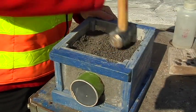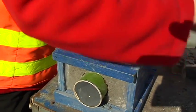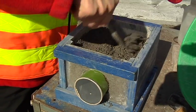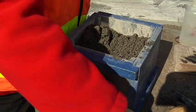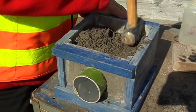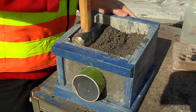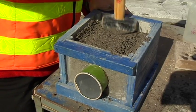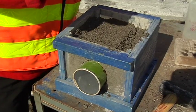When I get to the top of the pipe, I actually come up above it before I compact along the top. I do that for two reasons: one, I don't want to damage the pipe by hitting it with the compactor directly; and two, by compacting across the sides up a little bit first, when I do go across the top, it provides a little more lateral support to help hold everything in place.